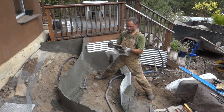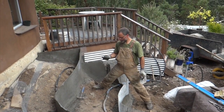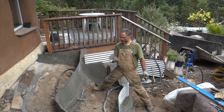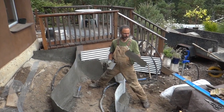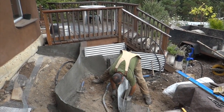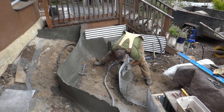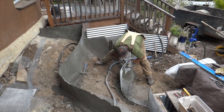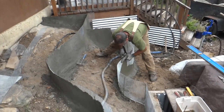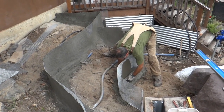This is some kind of a fancy cutting device that wasn't really good for anything - it's a piece of steel with a little edge. I've got a large tray at the moment; normally I like to use a smaller one. You just put it on both sides, take the concrete by shovel full and pull it up the expanded metal lath. The expanded metal lath is anchored into the ground, pounded in with some steel rod.